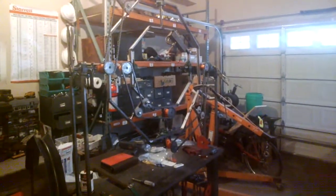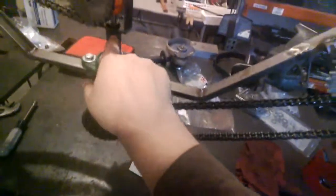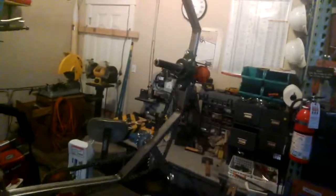All three are now mounted. I have it clamped in the vertical position so only two of the axes are live, but it makes a better demonstration. You can see it works. So now we have this external lever - it goes through here, through right angle drive, to this chain drive, down across these tensioners we just added, down to this sprocket, through right angle drive, through this slip joint, through another right angle drive, sprocket, tensioner, sprocket, right angle drive, and out. So this is where the inner maze would actually mount. If you watch that shaft there as I rotate this input - there it is rotating.